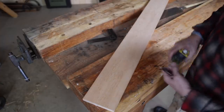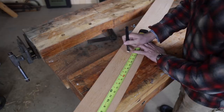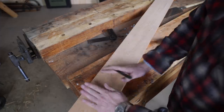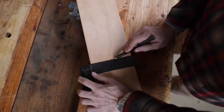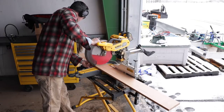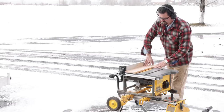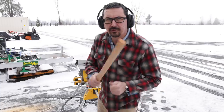We're going to have about twelve pieces altogether. The first piece we're going to cut is 22 inches long by four inches wide. We'll rip this on the table saw to three quarter inch thickness. Make sure whatever wood you pick up is clear vertical grain or doesn't have a bunch of knots, because we're going to need some strength in it. Clean wood, no knots — or if it does have knots, make sure they're very tight. Square your edge and make your first cut.